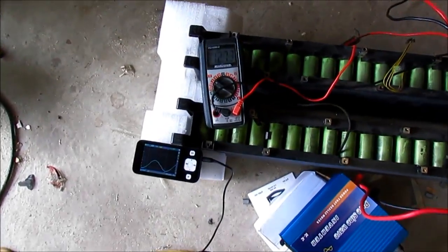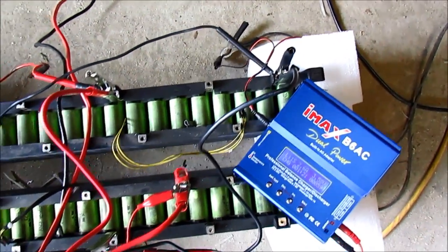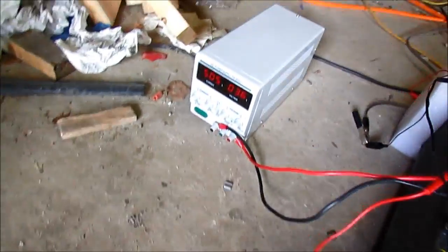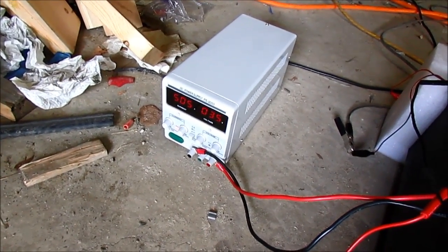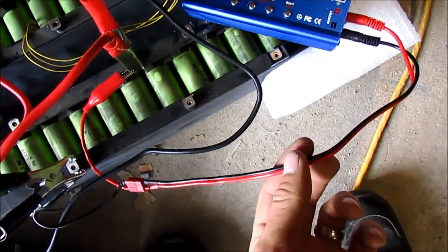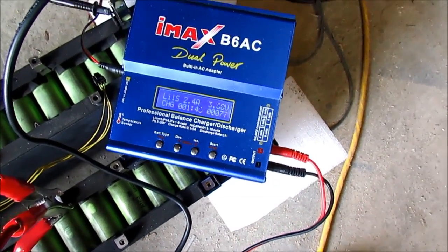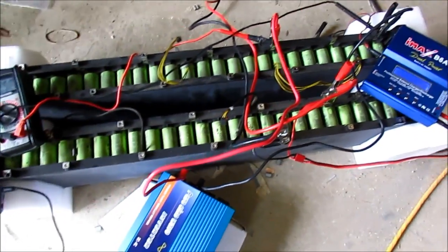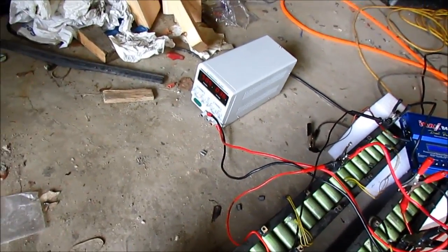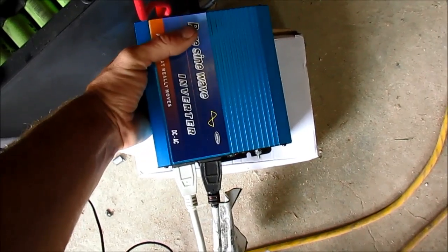I haven't had it long to see how long it lasts, but this is running a 300 watt light. There's no chopping off at the top or bottom or anything like that — it seems to be fairly nice. This actually has almost as clean a sine wave as my Go Power 300 pure sine wave inverter, which I'll be doing a performance test on as well. I am very very impressed with this little inverter so far. I just started the discharge of my third bank — that's one, two, three, four groups of cells.